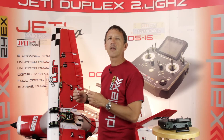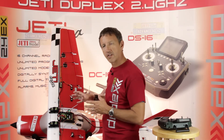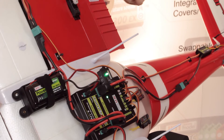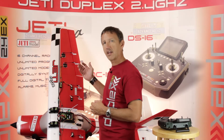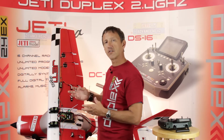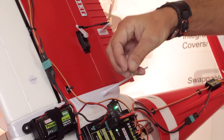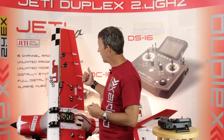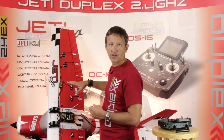This gives you the option of running 24 channel output through the system. It's not the same bus system in terms of being a single cable output. What we've done is use the Central Box 400 and then run individual Central Box 100s on our wing panels and back at our tail. This allows you to move eight channels of output out to the outboard extremities with full control over each location. You'll have two connections — a power connection and a signal connection — going from the Central Box out to each panel and tail. In this case, we have single power, single signal, and we're running four servos off of each Central Box 100.